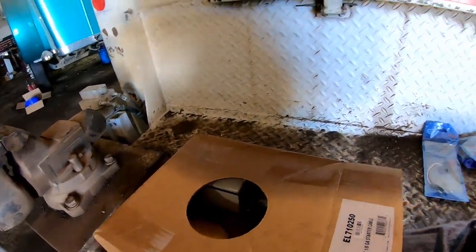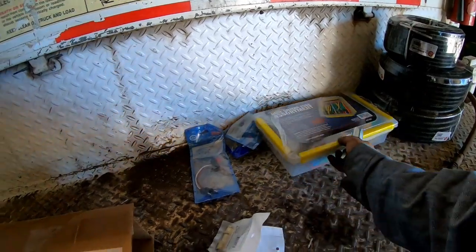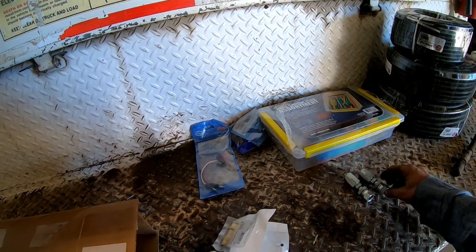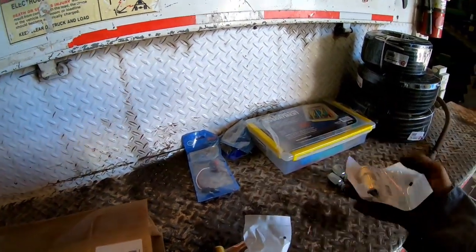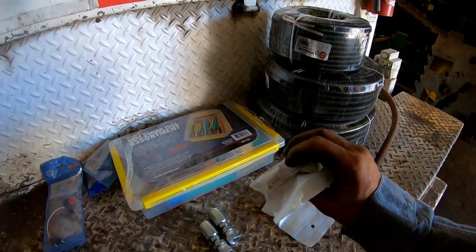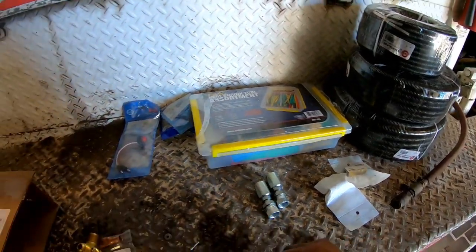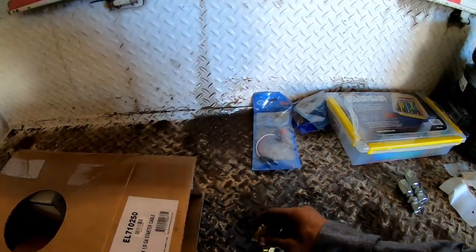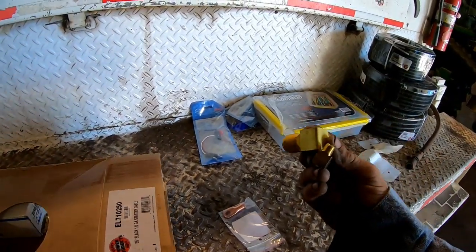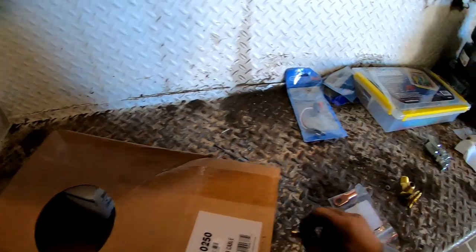We'll go over a few things here. A couple of reusable ends, I got some 201 hose, a couple five-eighths quick couplers. I've got assortments that go up to half inch on the quick couplers, airline splices, and the actual nuts and ferrule splices, but those don't go up to five-eighths. I'm hoping I got the right size there.